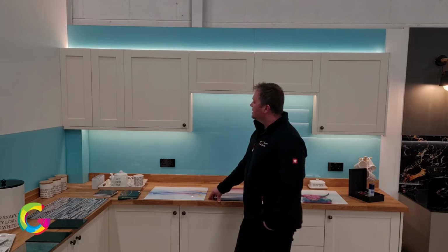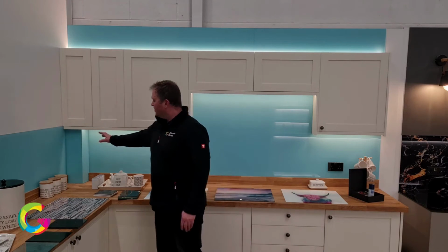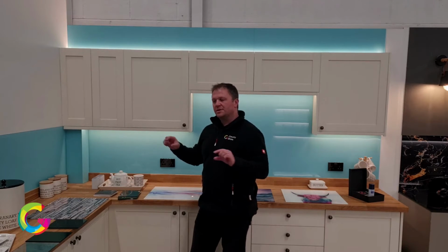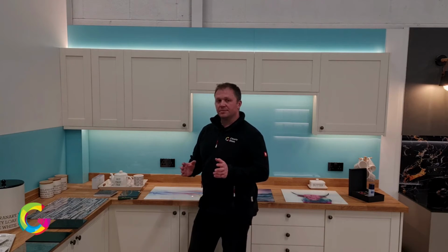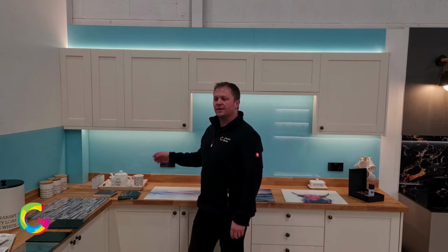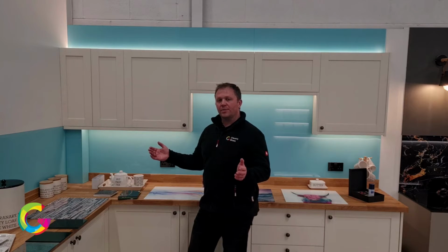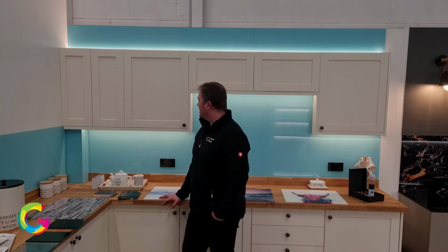Another thing to bear in mind is the minimum chargeable area of toughened glass. For small panels like this that go around boxing, also little panels on the sides of windows or strips underneath windowsills, sometimes the glass is quite small, so it's less than 0.25 of a metre squared, which is the minimum chargeable area for toughened glass. So if there's lots of small panels on the job, it can increase the price quite a bit, because you end up paying for quite a bit more area than you're actually getting because of the minimum charge. So that's something to bear in mind.